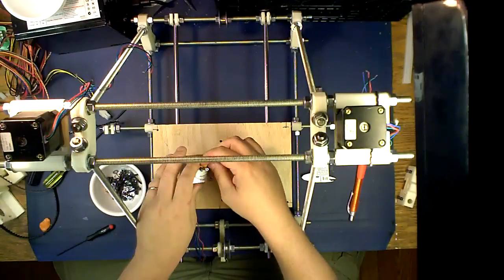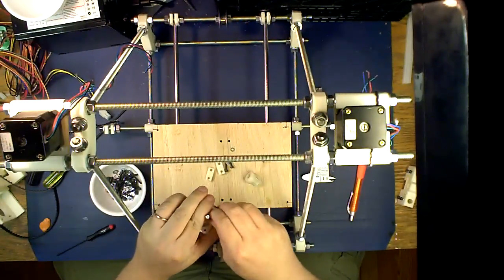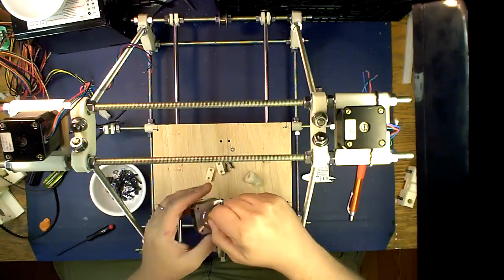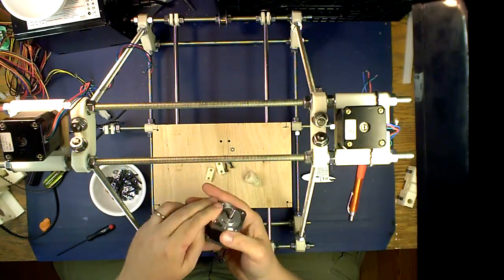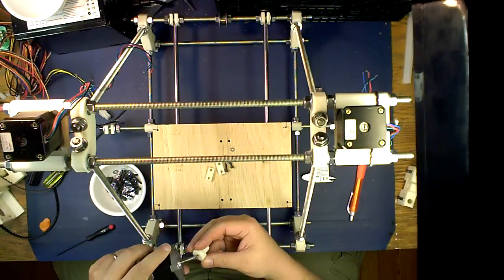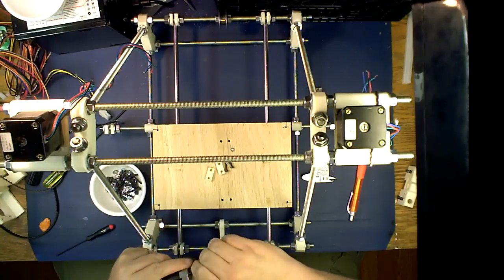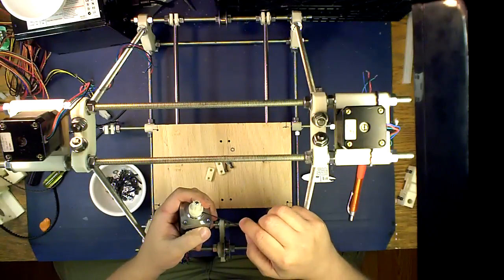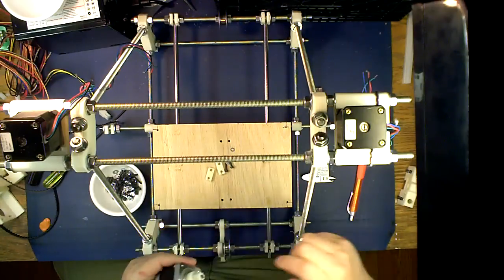You take it and you stuff it into the edge of the motor like this. Just fill that little hole right there. Do whatever shaving you need to do to the motor to get a flat, and then pull it off and reuse it 1,000 times. That's how I do it. But anyway, you get your flat, you go ahead and install your pulley onto your motor right up to the body of the motor, and you tighten down your grub screw. So that should not move.